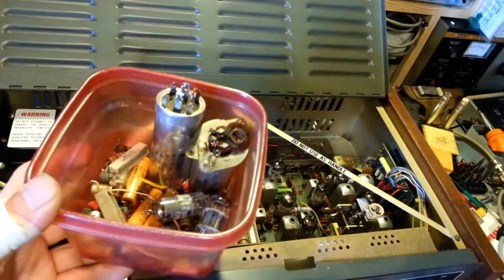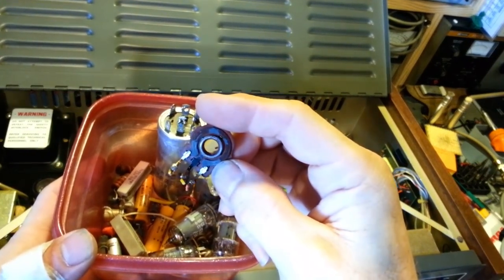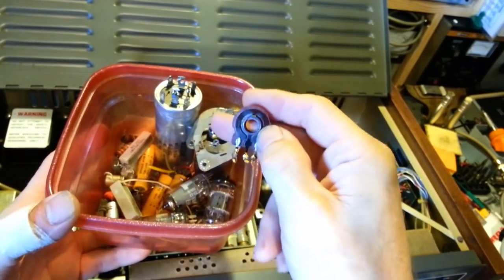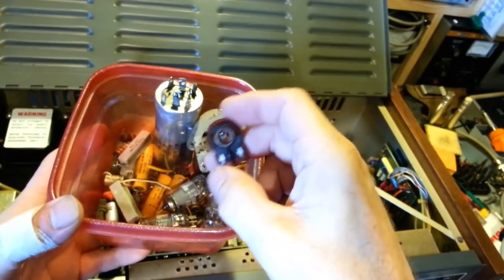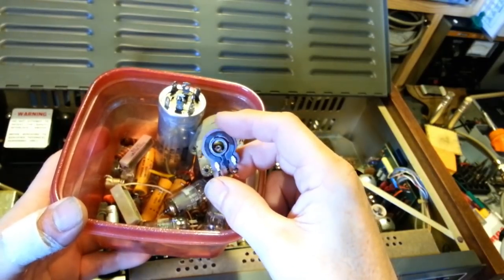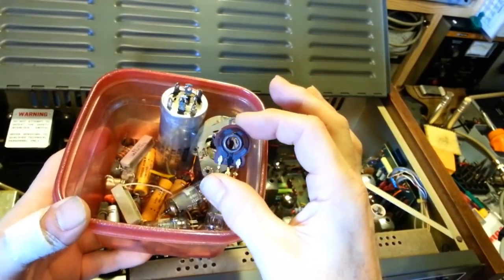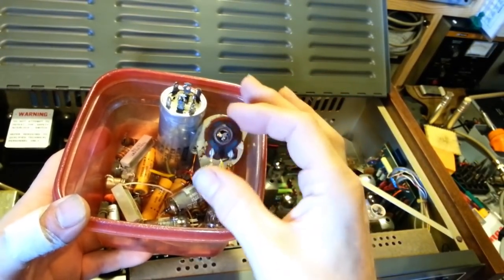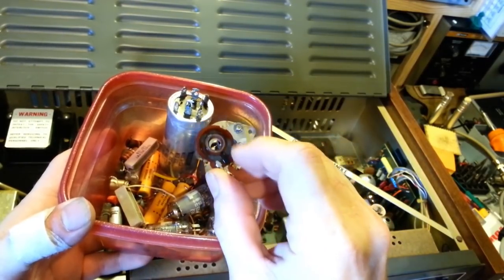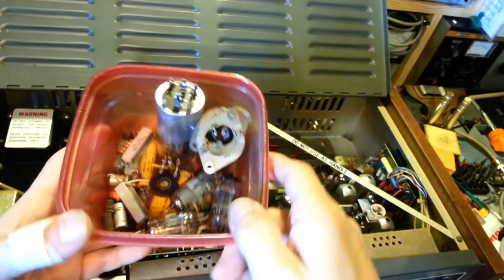There's actually just the empty tube boxes. Tubes are down in there. There's that section of the control that kind of self-destructed. And somebody may have, because I've seen that actually, some radios where all of the controls look like this, not just trams, anything. People use penetrating oil. They'll spray something like WD-40 or lubricating products in their controls. If you want this to happen to your controls, I guarantee you that's the best way to make this happen. Spray penetrating oil in your control, it just delaminates this resistive material off the controls. So yeah, use proper tuner cleaner type products on this.